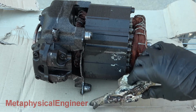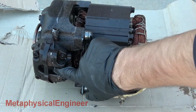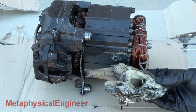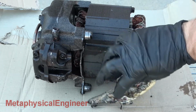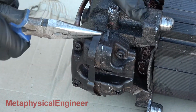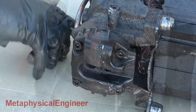This mess is a suction muffler / liquid separator, and it's supposed to be clipped to the valve assembly, instead of modern sculpture in the bottom of the compressor shell. It's barely recognizable. Even the insulation of the wire harness has been baked until it's crumbling. Surprising, nothing shorted out. Here's the clip where the suction muffler should have been before it liquefied.